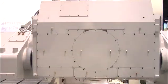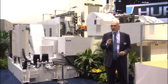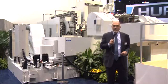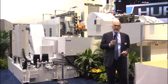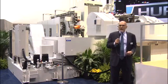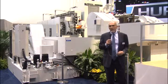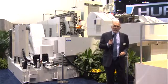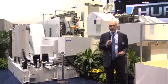Applications include aerostructure components, valves, rock bits, a variety of components for oil and gas, and aircraft engine components such as engine cases, compressor cases, and fan frames. The tilting table and fixed spindle design provide very rigid construction. Mitsui's overall accuracy is fully respected, and the higher metal removal rate means lower cost manufacturing for the customer. Mitsui's uptime, reliability, on-site support with service and applications engineering make 5-axis machining a reality today for almost any customer.